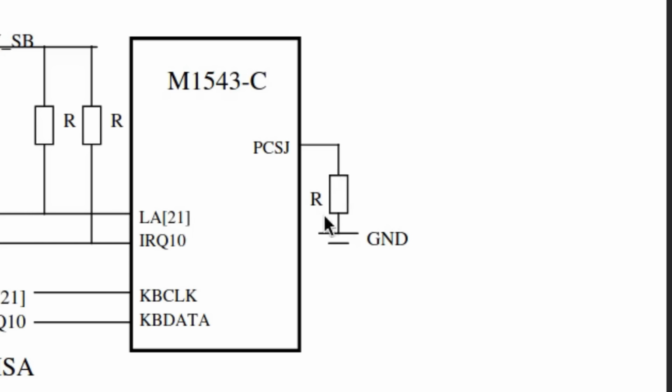Nice. One interesting thing which I would like to test now is another CPU. You see, on the RetroWeb it has been said that due to a hardware problem of P5A in revision 1.05 and 1.06, it will work extremely slow with K6 Plus CPUs. Those are K6-2 Plus and K6-3 Plus. The revision of the board which I have is 1.04.